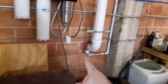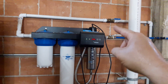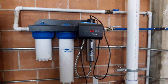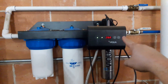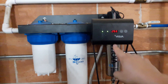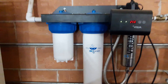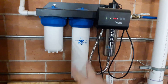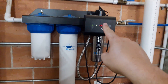The water is plumbed back in from a pump outside, comes up here — we have a shutoff valve there and it comes through our filtration system. It runs right into the Viqua UV sterilization system. This right here counts down how many days until you need to change your lamp; it's good for 365 days. It comes with a 5 micron sediment filter and then a carbon filter, and then it flows through the UV and then into your sinks.